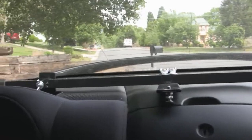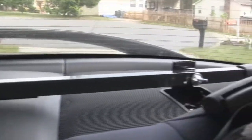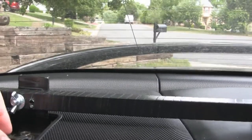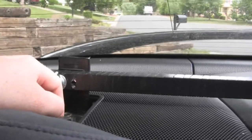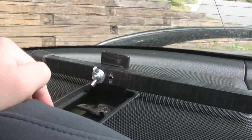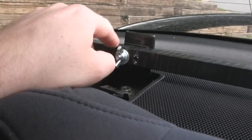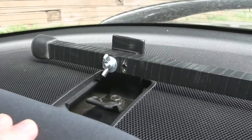What I've done is take that three-quarter-inch aluminum and place those rubber ends on it so it looks a little cleaner. I went into my latch system, took the bolt off — since this piece is less than an eighth of an inch thick, it should not affect the latch system. I put the latch in, put a bungee cord to it, tied some rope, pulled it, then put another cord on it and put all my weight on it. There's no way I can move or budge the latch, so it feels safe. Drilled the bolts, and wing nuts only have one end right now — I'll do two ends if I'm going to do more aggressive driving or go to a track. For this test it should be fine.